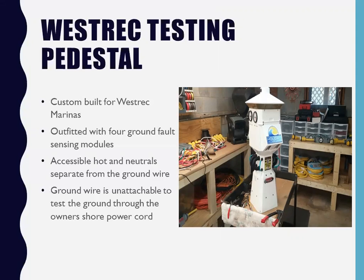So literally, if I get a break, normally it's a galvanic isolator. They get nailed by lightning strikes, surge electricity, whatever it is. They're so simple to bypass. You can just take the jumper cables and go clip, just bypass, and that solves the problem. Normally you get your ground back.